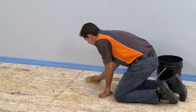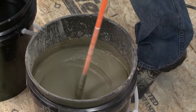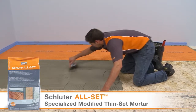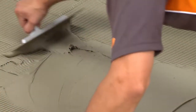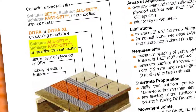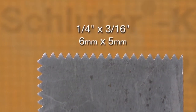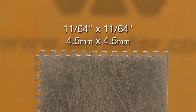Now we're ready to begin the installation. DITRA is installed simply and easily with thinset mortar. We will use Schluter Allset Modified Thinset Mortar to bond the matting to the wood substrate. Schluter Fastset Rapid Setting Modified Thinset Mortar may be used as well. If you are not using a Schluter mortar, a modified thinset mortar is used to install the matting over wood. Always verify the proper type of mortar required to install DITRA based on the substrate. The mortar is mixed to a fairly fluid consistency, but still able to hold a notch. A one-quarter inch by three-sixteenths inch V-notch trowel or the Schluter DITRA trowel, which features a 4.5 millimeter by 4.5 millimeter square notch design, is used to apply the mortar.